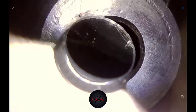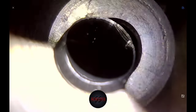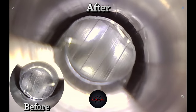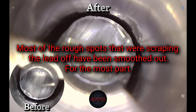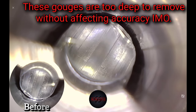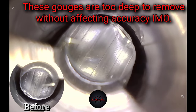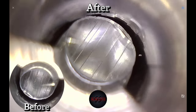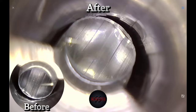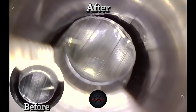So finally done lead lapping this bore on the Savage. Let's see what we got here. Now this was some work. There are still a few little machining marks on it here and there, but for the most part this was not the cleanest. I may have to spend some more time on it. I thought I had them all, but that's how bad this was — the machining is just absolutely horrible on this barrel.